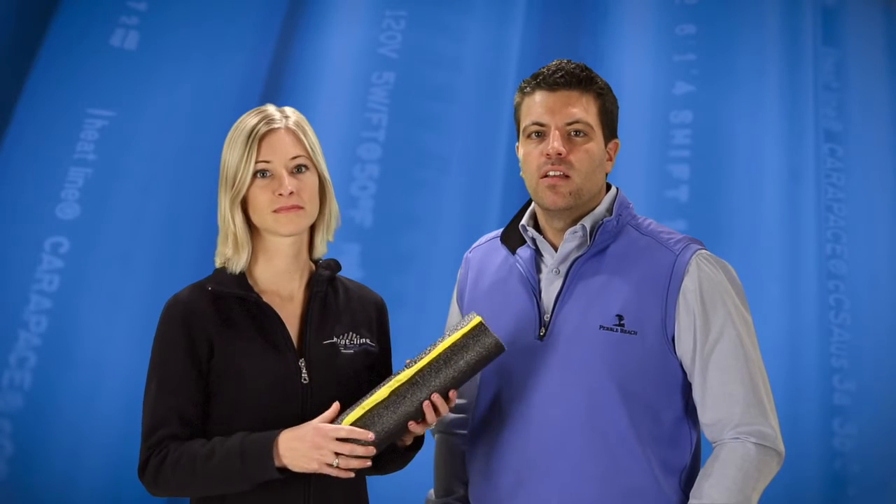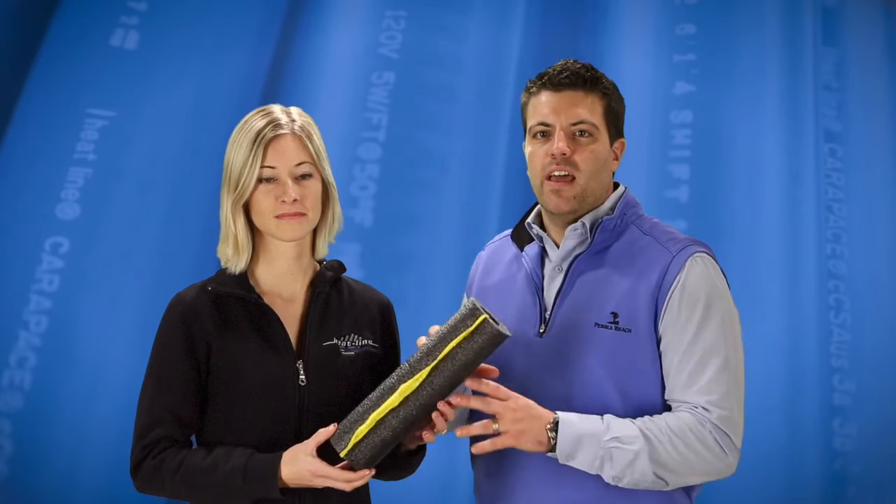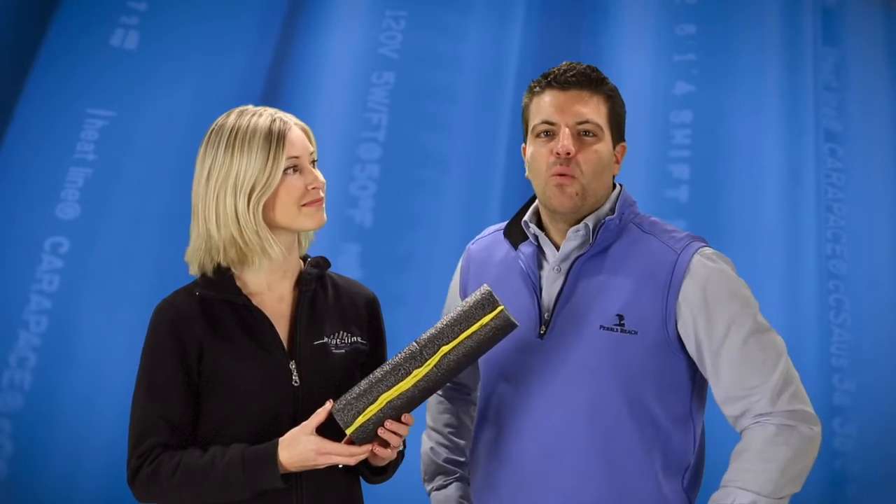If your pipe is outside above ground it must be insulated — a conduit or big O is not enough. In extreme cold weather, especially days when there's wind chill, it's important to make sure every inch of exposed pipe is covered with insulation. When using insulation sleeves they may slip apart, so these sections should be taped together. Once all areas of the pipe are well insulated, the heating cable will be able to thaw out the pipe.